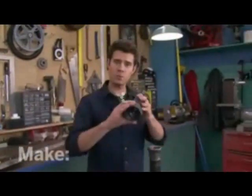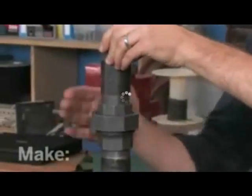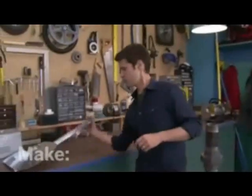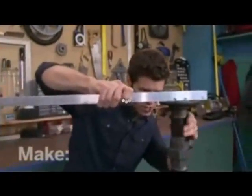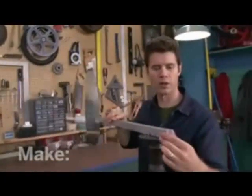So that the frame can spin freely in the wind, I'm going to attach it to a pipe union. The way this works is I'll set these 2 together and screw this on, but leave it just a little bit loose so that this spins freely. Now I'm ready to screw the frame on. I'm just attaching this pipe flange to the pipe nipple, and now this will turn freely.